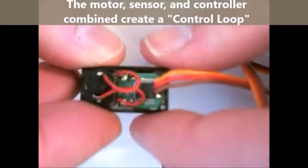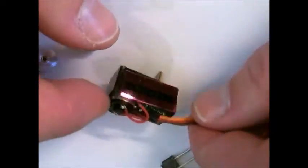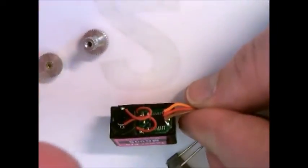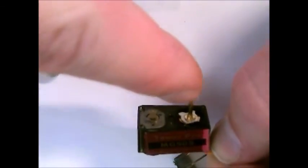So if you send a PWM signal interpreted as 65 degrees, this chip will turn on the motor until everything rotates and the horn on the servo reaches 65 degrees, at which point the sensor will read 65 degrees, tell the chip, and the chip will turn off the motor. That's basically how a servo works — a small brain with a tiny sensor that measures the angle it's at and a motor. The motor and gears give the power, the chip converts the PWM signal to an angle, and the sensor reads the servo position until it reaches the desired angle, then turns off the motor.